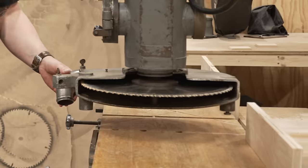Get sketchy. I want to do a ripping cut where you turn the head, and this is a ripping out, I believe it's called, because the saw blade's facing out. Now this thing spins like this. That means if I go from this direction and feed it, it's gonna shoot the material off the saw. They also have a ripping in. Now, where the blade is facing me, I can feed into the blade as it cuts.